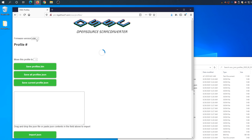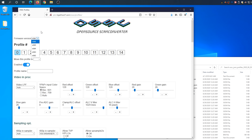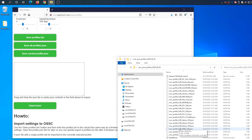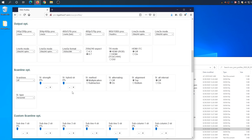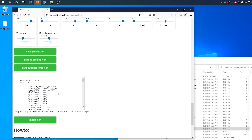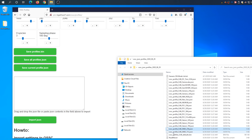Just extract those to a folder on your desktop. Next, go to the OSSC online profile editor, which is linked right on FBX's page. This will allow you to create a custom set of profiles based on the systems you use for each firmware revision. Since we just updated the firmware to version 0.8.6, I'll make sure that's what's selected from the dropdown. I always label the first profile generic and leave all the settings as-is, since they match the generic timings of a new OSSC — this way, if you have consoles without custom profiles, you can always go back to these generic settings.